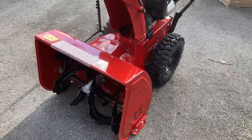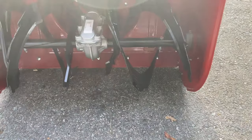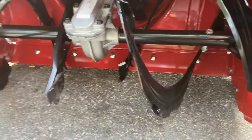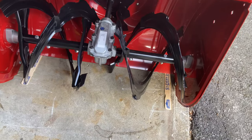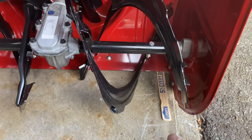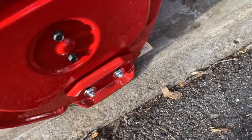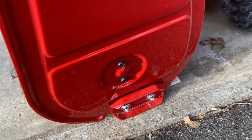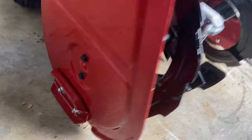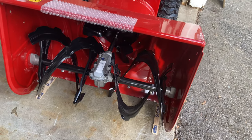The next part of this assembly is to check the clearance of the blade at the bottom of the bucket. There seems to be a decent amount of clearance on this one — it looks like it's already set from the factory at an eighth of an inch. If you have to set the blade clearance, the directions say to use a couple of paint sticks, which happen to be about an eighth of an inch thick. Put one on each end of the bucket, loosen the two bolts here to bring the skates down to the floor — using the garage floor because it's a level surface — then tighten them up. Do the same on the other side. Mine seems correct out of the box so I'm not going to mess with it.